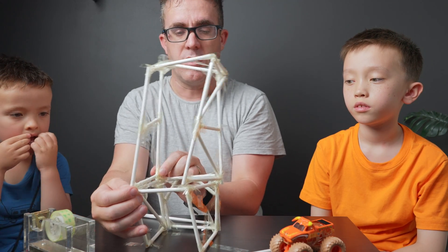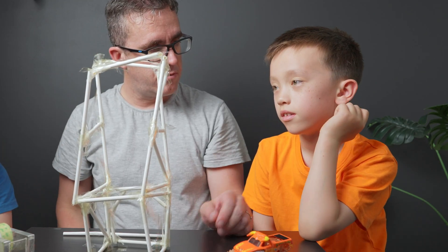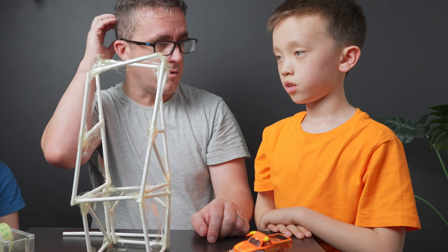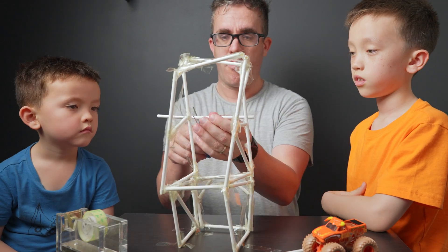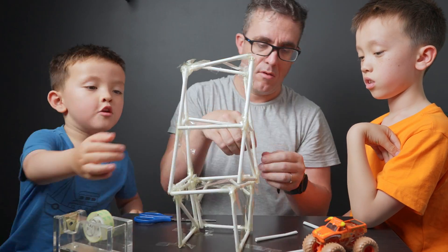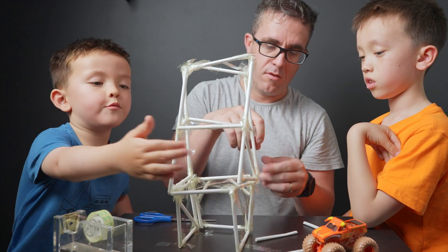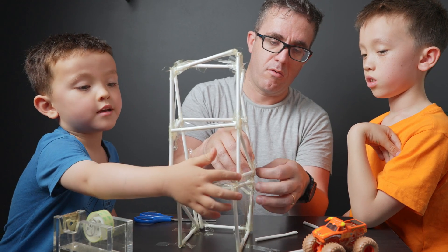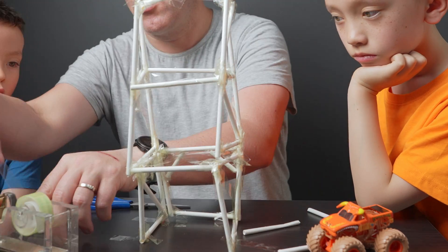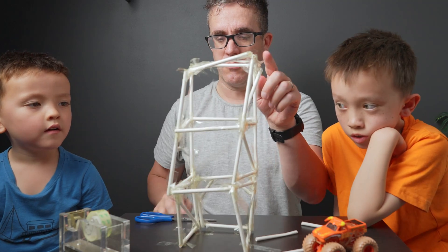We've raised the top now, but we've got to brace the sides. Which bracing do you want to use — cross bracing or which way? It's still wobbly because we haven't got bracing points. You can put a cross-bracing here — because this is broken — put a big cross-bracing there to get stable. We're going to make sure all the columns are aligned first, just by adding some tension ties between them.